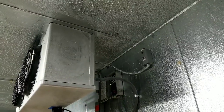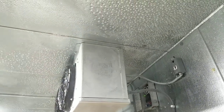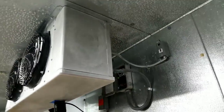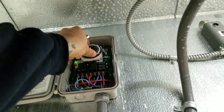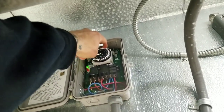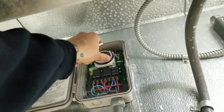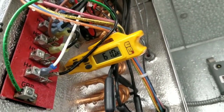I'm going to put it in defrost and re-verify that my defrost termination switch is taking it out of defrost. I'll run two consecutive defrosts right here. We're 35 minutes into this defrost cycle — air temperature in front of the evaporator is 60 degrees.